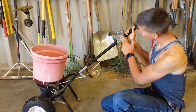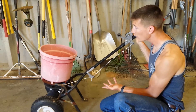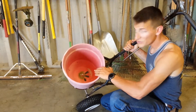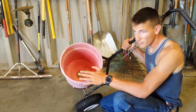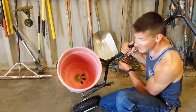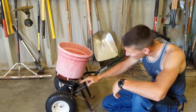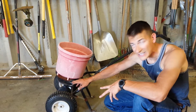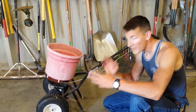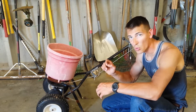Once you've confirmed your lever is set to the right amount, make sure the rod here is not too badly bent. A little bending is fine, but what you want to ensure is that the holes in the base of the bucket are closing all the way. If they're not closing all the way, that's a serious problem — you could be spilling fertilizer, pesticides, or other material. If the rod is badly bent, the holes can either stay open or closed, which is a problem. Also check that the little panel with the blades at the bottom is actually spinning when you spin the tires — that's what spreads the seed.